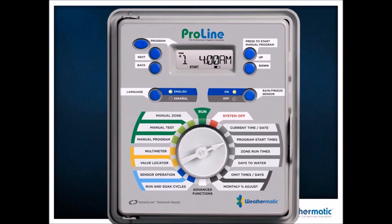Notice it says 'Start' in the display — that's 1 through 8, and we can turn those off so they don't display. A big program mistake is people programming too many start times, so we're able to turn those off. Start time number one in program A is what we're seeing right here, and I could toggle to program B and do the same thing. I use my up and down arrows to change that start time.